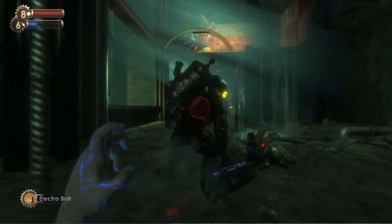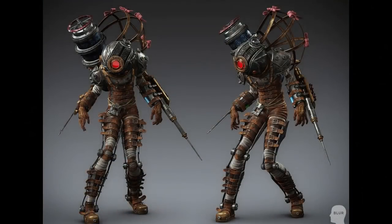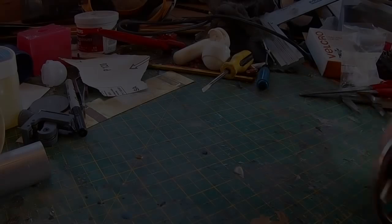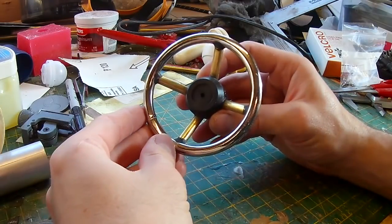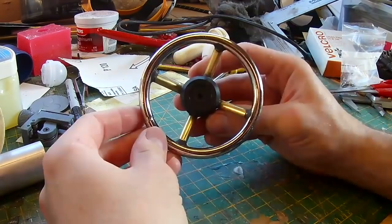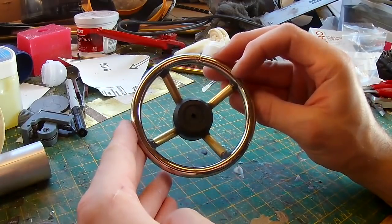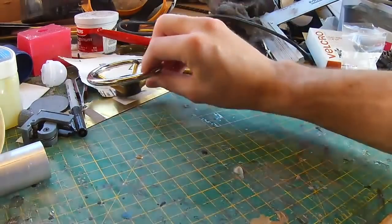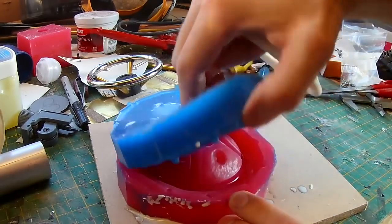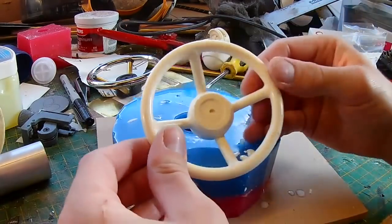Going with my Bioshock aesthetic I've decided to make a sort of backpack with some pressure vessels on it, so I need a pressure valve wheel to add to them. I couldn't find anywhere to buy something large enough, so I've made one. It's based on what I think is a piercing ring - a ring of the exact diameter I needed. I've added some brass tubing onto a lathed piece of acetal to create the basic shape for the pressure wheel. I then made a mould of it so I can cast up as many as I need - it's a two-part mould where you pour your material in the top and it flows through.